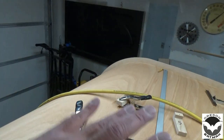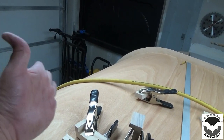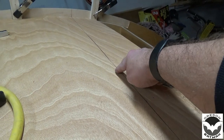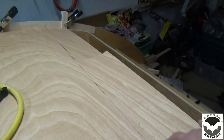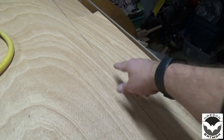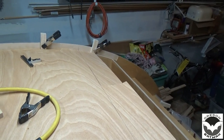Let me show you what I did. I actually had to turn my wood all the way around and start at the other end to get the front around, because when I first put it in there, it bowed on me, and when I pushed it back, it split right here. Which is no big deal, because my cabinet goes across here where I have a line. We're going to go ahead and get things fastened down, take a straight edge and a knife, and score that. That's where the seam will be, so you won't see a seam on the inside of the trailer — it'll be hidden on top of the cabinet, which worked out great.